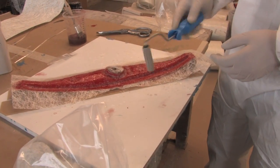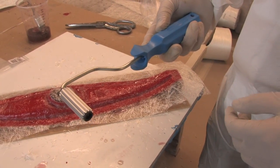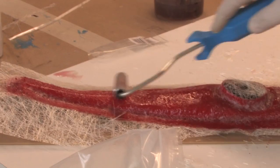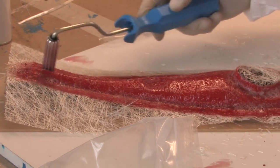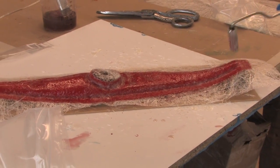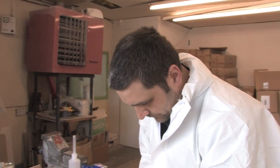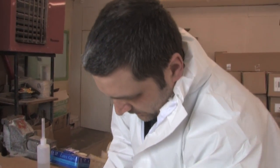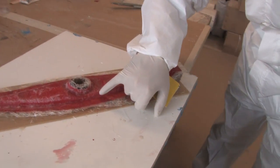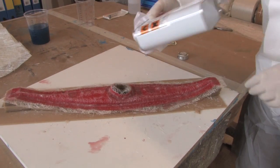Now we come to the paddle roller — it's an aluminium ribbed roller, which we use to consolidate the fibreglass to the gel coat. Just rolling that over the fibreglass makes sure the resin is well worked into the fibres. Now that our first layer has cured off and gone hard and crisp, we're just going to sand off any splinters or fibres on the corners. Then give it a light wipe over with some acetone.